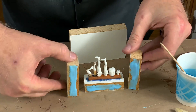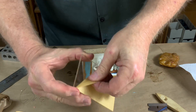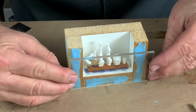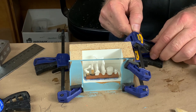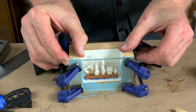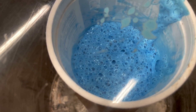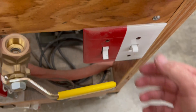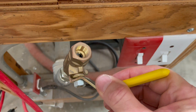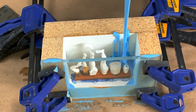Using a rubber gasket is the simplest way I've ever found to make sure the mold case doesn't leak. The plexiglass front panel is strictly for the video — people love watching the molds get filled. The best thing about building a small box like this out of thick wood is that it holds together with just a few clamps. I mixed up 100 grams of rubber and popped it into the vacuum chamber, which does a very nice job of sucking out all the air. When that's done you close off the chamber, turn off the pump, open the chamber, let the air back in, and then pour the mold.